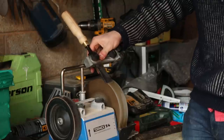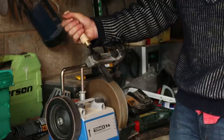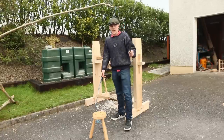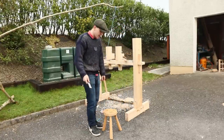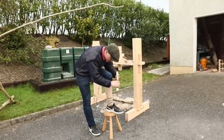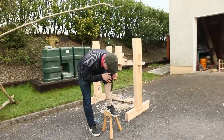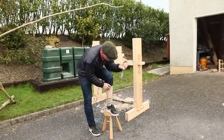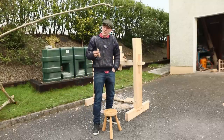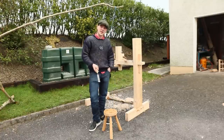This Sheffield steel is very hard stuff, so instead of wearing myself out I might as well put this machine to good use. The bevel it's at right now is about 25 degrees and then I'll come along after this and put a nice 30 degree secondary bevel on it. Well lads, here we have it — good and sharp. I just took it from the strop wheel quickly and now we can see that it's shaving good and proper. Don't judge the socks, it's very cold here at the minute. If it's lined up right it will just shave hair clean off your legs — that's pretty much as sharp as I like to get all my chisels. Anyway, great excuse to bring out the old pole lathe. I'm fairly happy with this chisel now — nice ash handle, probably last me a couple of decades. Yep, thanks for watching and I'll talk to you again in the next one, good luck.